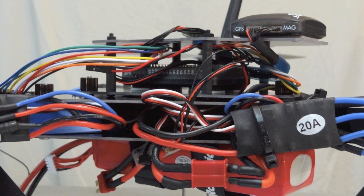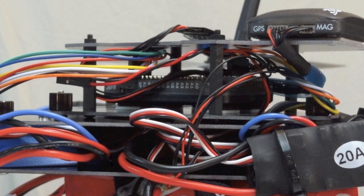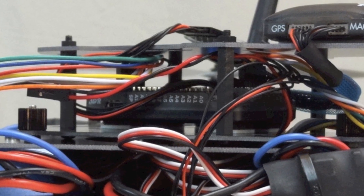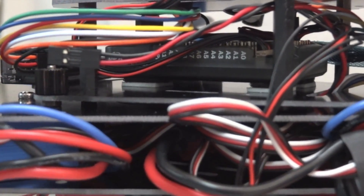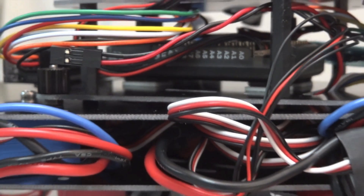This is where it gets interesting — where do you put all that stuff? You may also note that even though I'm using a 2.6 APM, I'm using a top pin model and not a side pin model, so that can be a little tough to get those connectors in there when they're facing upward. 3DR provides four little foam sticky pads to stick your APM to the Y6 copter. They're so soft and flexible — and of course they do that for vibration — but any resistance from the cabling tends to make the APM tilt to one side or another. I think 3DR needs to come up with a better way to mount these APMs to their copters.